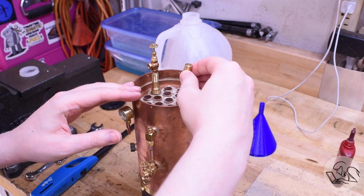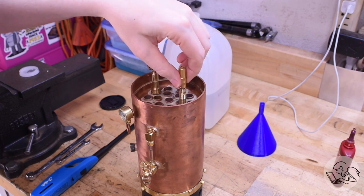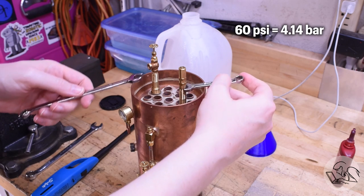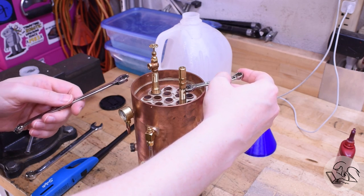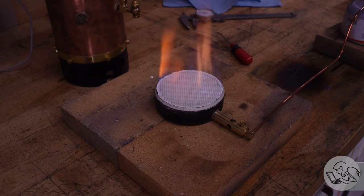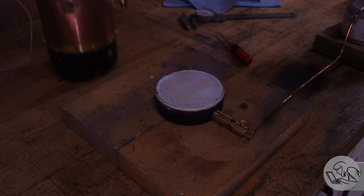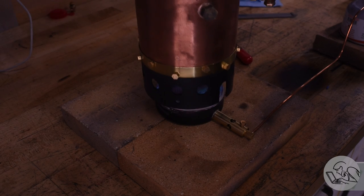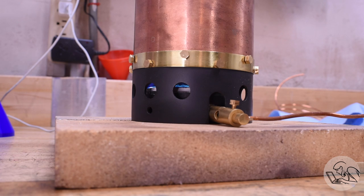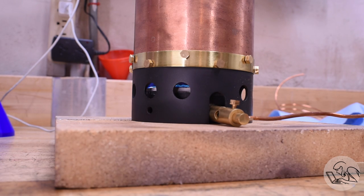The safety valve I've been intending to use for this boiler is this one from PM Research. It's the only one they sell, so I bought it. It's set to go off at 60 psi, which is what I want, so it seems like a good fit. Time to kick the tires and light the fires. I'm going to light the boiler outside so I can see what it looks like, and it looks fine, so I'll set the boiler down on top. You can see the flame percolating away down there, and we are officially heating water for the first time in this boiler. Very exciting.